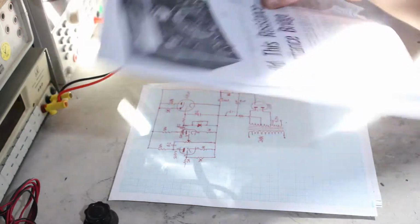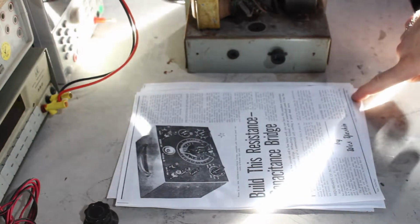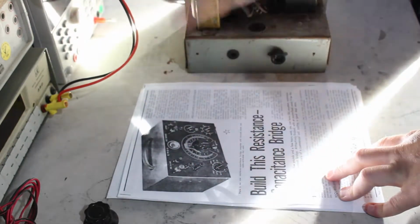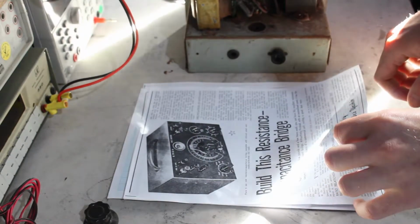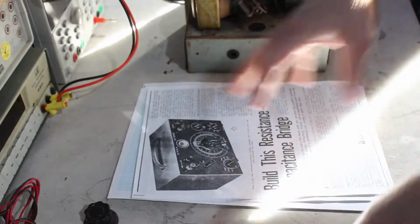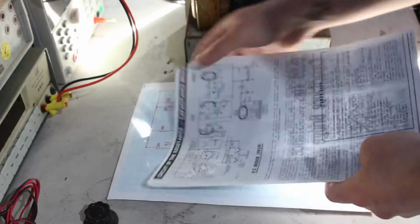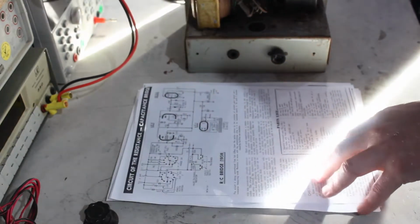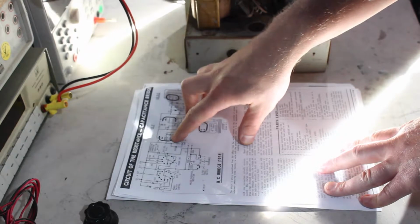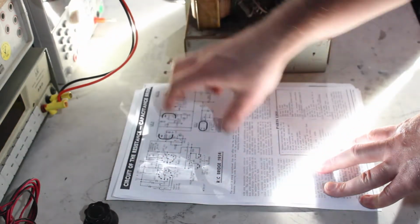And since then, I have discovered the updated version, which was from September 1958, so about 4 years later. And this has all the new features, new front panel and everything that match up to this. Although this does use that 12AX7, which, as I've traced out, is legitimate, they have deviated from the circuit diagram, which isn't that unusual, I guess. They've gone and done their own thing with this. So the original uses a 6U8, which is what you call a pentode triode. But otherwise it's all pretty much the same deal.